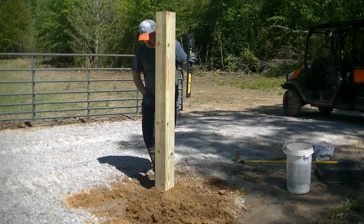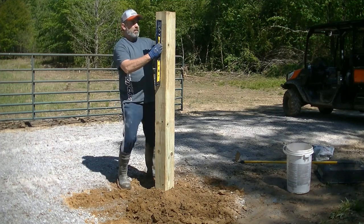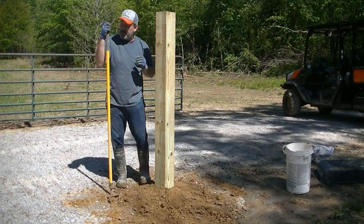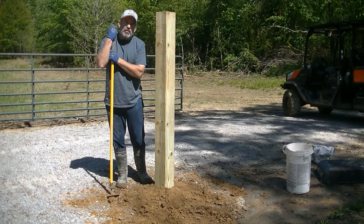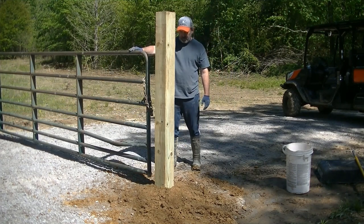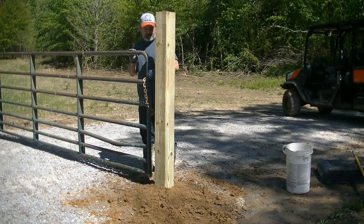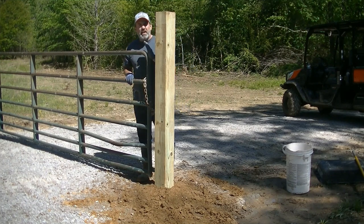This is the time to make fine adjustments before I pack this down, so I want to make sure we're still straight. It's nice and solid with that dirt all the way up to the top. Keeping it straight while I pack each side. We have one straight gate post in the ground, concreted, straight opposite our other side. We have our gate - let's close it and see how it looks. We're just a little over a hand's width from the edge of the gate post.